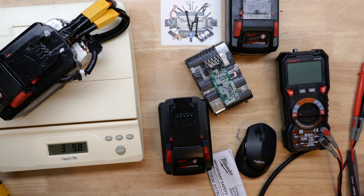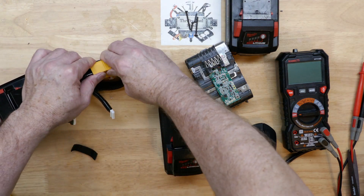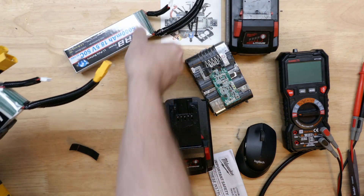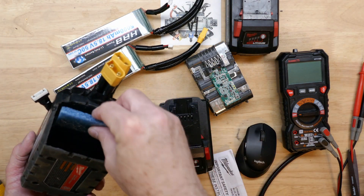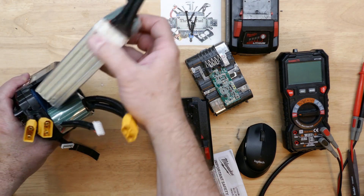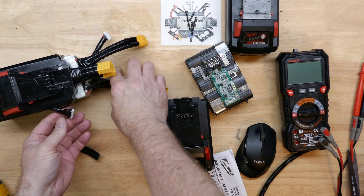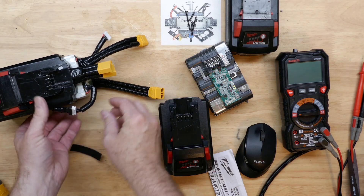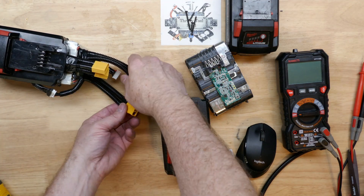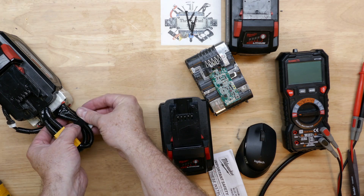The Beast weighs right at three pounds ten ounces. To show how it's put together — I can simply remove the LiPo packs. The reason I did it this way is so hopefully this pack never has to be taken apart again. I get 10 amp hours with the BMS board secured with silicone, covered with a rubber mat and a piece of foam to keep separation and hold the board in place. They fit perfectly; with that foam I can slide it in with one finger, hook up the balance leads, and use a little monitor on the other balance lead when charging. You could also charge this with a hobby charger individually, or put shorter packs in for 5 amp hours if you don't want it sticking out.